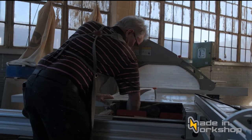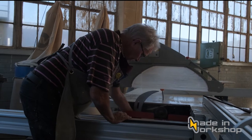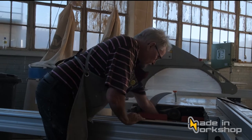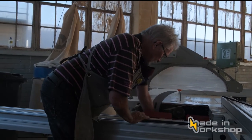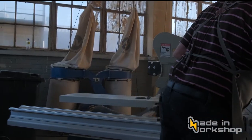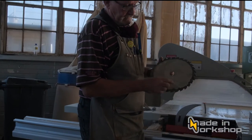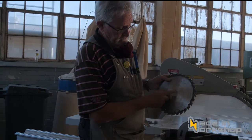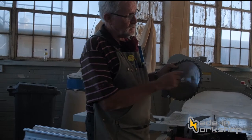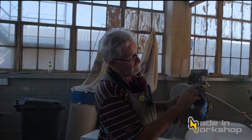For the purpose of today's demonstrations, we will probably not run dust extraction because the dust extractor creates extra noise that the video might not pick up. I'll take this opportunity to put a sharper blade on here. That slightly bigger blade — those parts there are called the arbor, in this case 30 millimeters, which tells you the shaft size of the saw. To count the teeth, you take two of those little holes and count the teeth between them, then multiply. That gives you the total number of teeth.